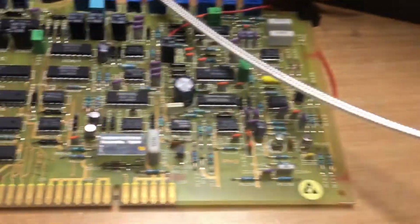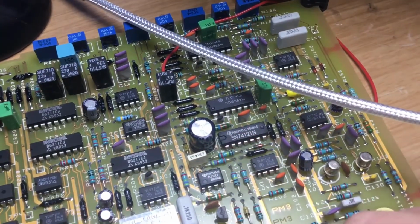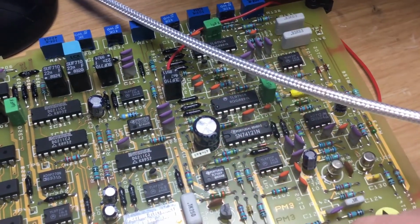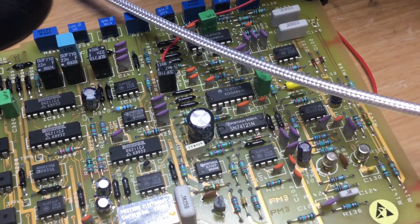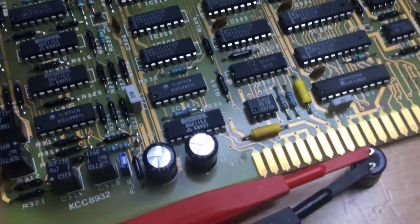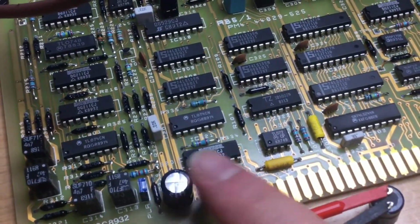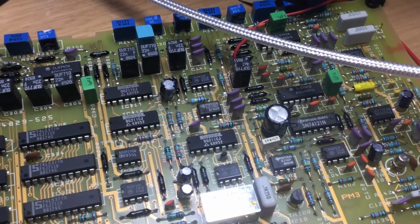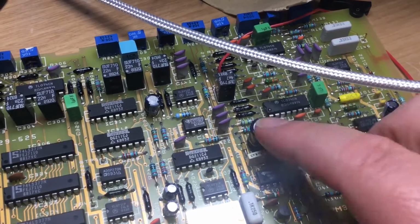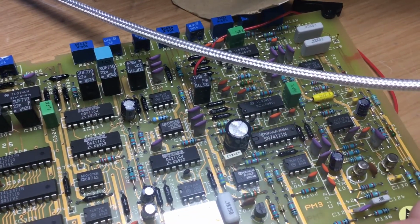Now what I've done before making this video regarding this particular fault that we're looking at today, I've actually removed this capacitor from the circuit and measured it, and I've just put it back in for the purposes of showing you this video. This capacitor is the same value and rating as that one, and it's short circuit. Now there are two other capacitors on the board as well, which supply other parts of the circuit board, so I'm going to change these anyway because they're all the same value, 220 mic at 16 volts. But it's interesting how I've had two test sets now with the same problem, where the 16 volt 220 mic caps are a short circuit.